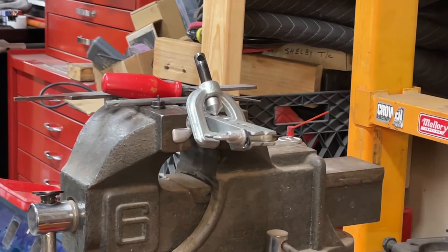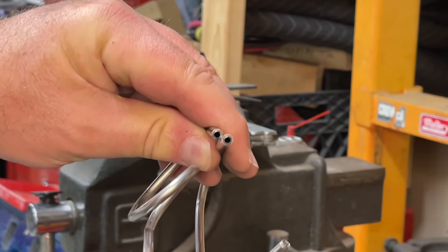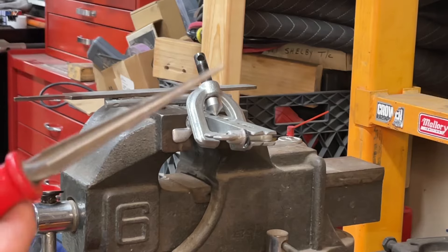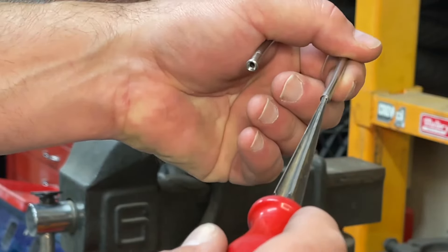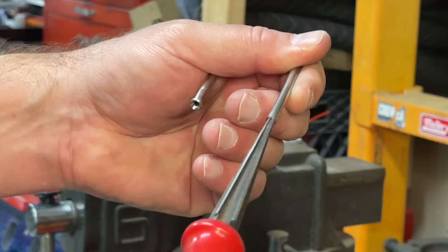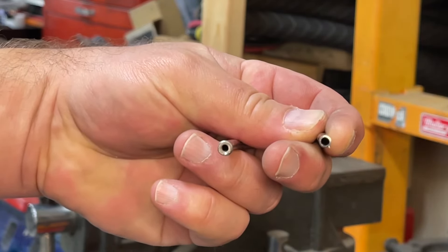The first thing I want to show you is the ends of the tubing, and this is important because what you're about to see is one of the reasons some of you guys are struggling with flares. When the tubing cutter cuts the end of the tubing off, it closes in the tube. And because it closes in the tube, you're going to need a ream. You can use a long ream or 45-degree reams — whatever you have available. You want something that will fit in there and open that tubing up to its full size so it's the correct standard size inside.